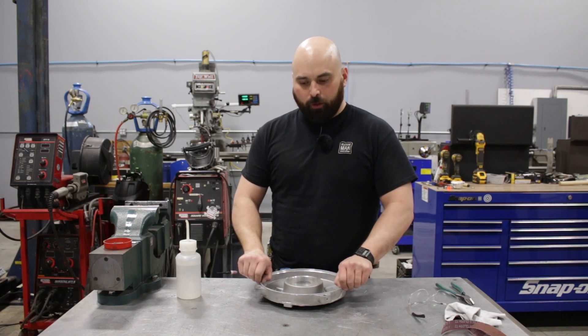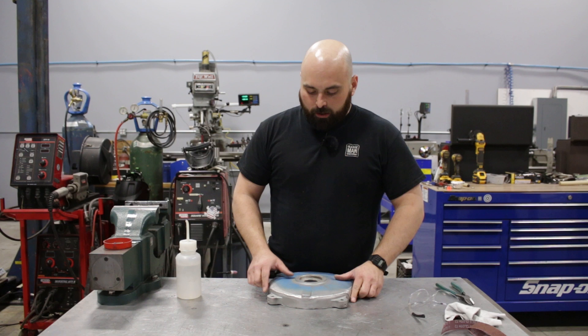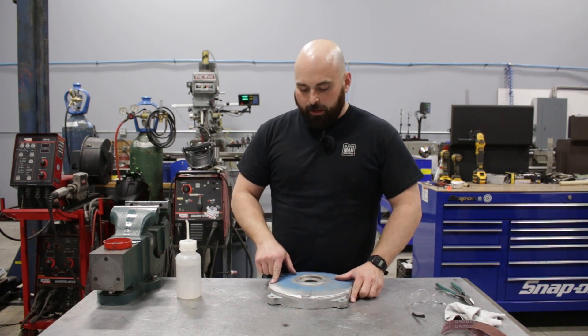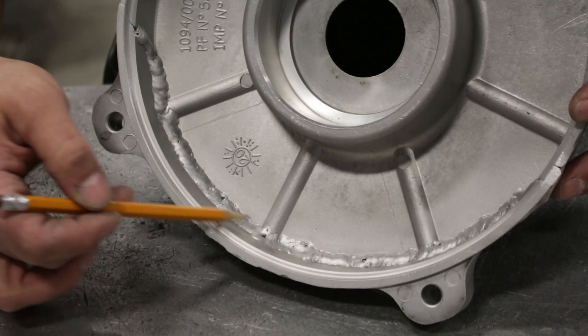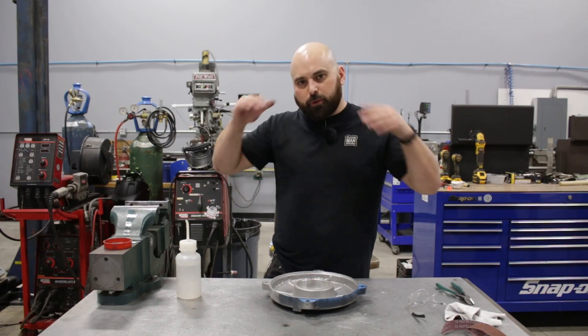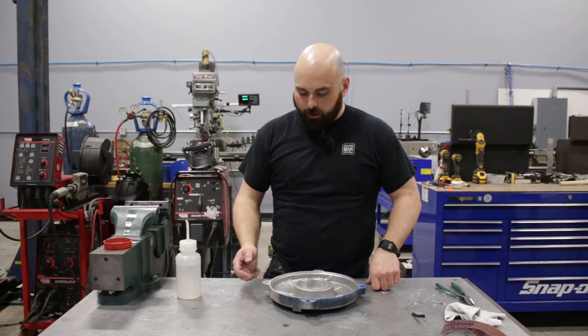It's just feeling really good — I'm going to call this done. The welds turned out well. It's never a beauty competition on fixing old things like this, but the outside did weld really well. The inside had more porosity and stuff come up in it — we left some of that fractured area there without beveling completely, which does keep scooping up some of that debris.